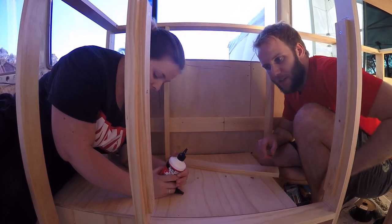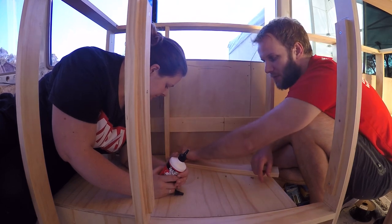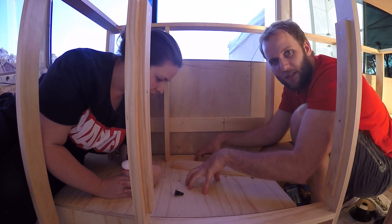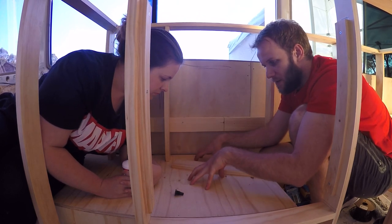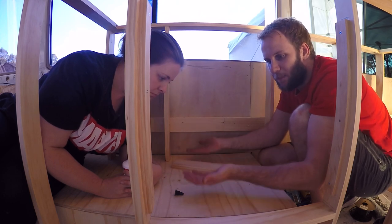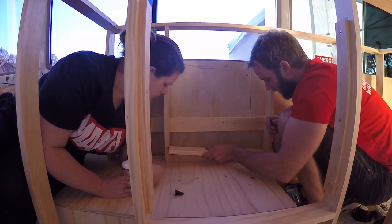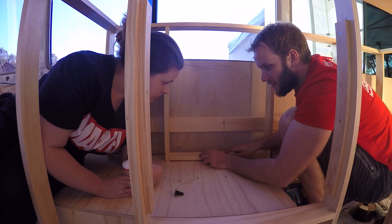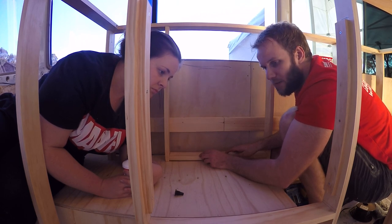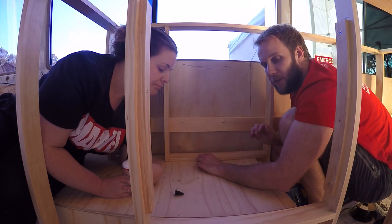What we're doing now is we've had to measure the height from where our oven needs to go down, and it's just about here. The problem is the wheel well box that we built is slanted, so we can't just put something on top of it to prop it up to the height that we need. So what we're doing is we're attaching two pieces of wood between our uprights, seven mils down from the height they need to be, then we'll put seven mil ply on the top, and that will form our base for the oven.